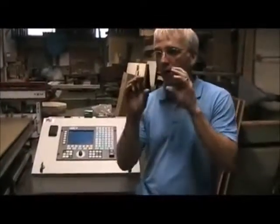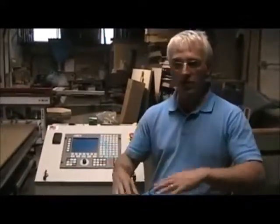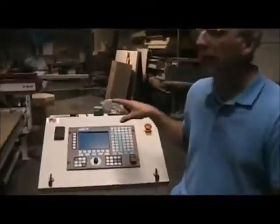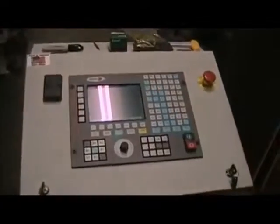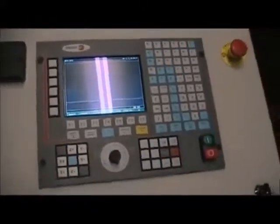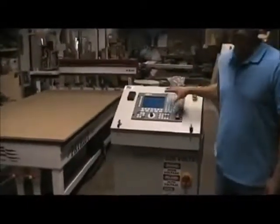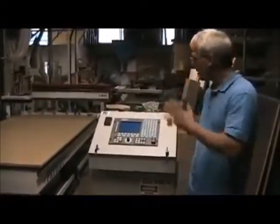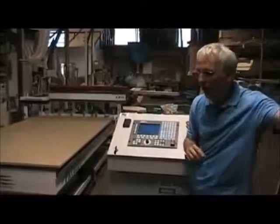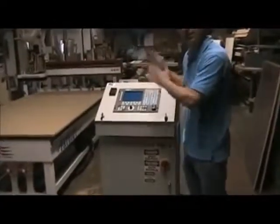Number one, any Windows software controller is dealing with everything that Windows is always doing — out on the Internet and this and that. We actually even tried to put a Windows PC control on this machine, but what we found is that Windows was losing contact with the drives. That's a fairly regular situation because Windows is trying to do too many things. I like to call the Fagor a computer with tunnel vision — its only job is to run this CNC machine. It's not trying to update its software or be accounting software. It's totally dedicated to this machine tool.